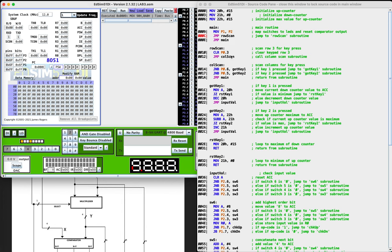We'll jump to the row scan subroutine just right here. I'm using the keypad for the button inputs for the upcounters and the downcounter. The first is going to check the row. The keypad is set up in a matrix, so you're able to detect a key press using a row and a column. The first thing basically clears the keypad for any previous presses.